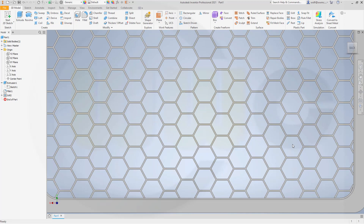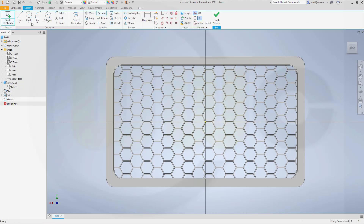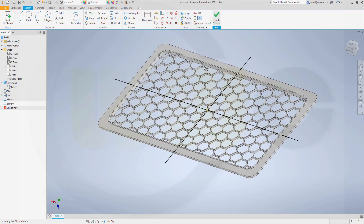Okay, this looks pretty good. So the next step would be to bend this part. Therefore I need two sketches. These sketches consist only of lines. So let's go for another sketch on the XY plane - one to bend it here in the middle. The bend would be horizontal. Make this the midpoint here. Finish that sketch. And the second sketch again on the XY plane would be another bend line around here. Let's align this point to the midpoint. Finish that sketch.